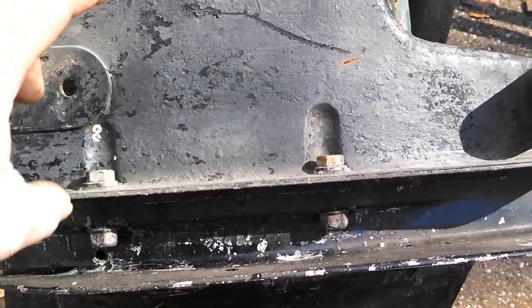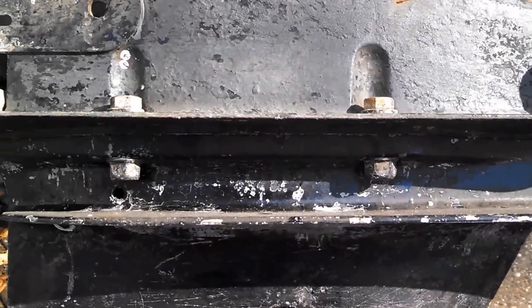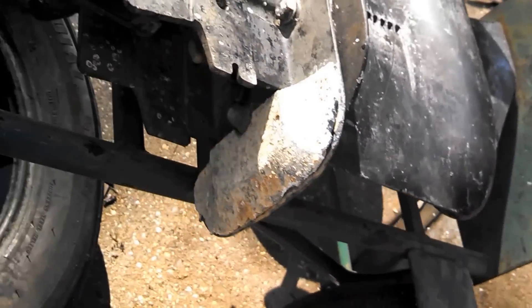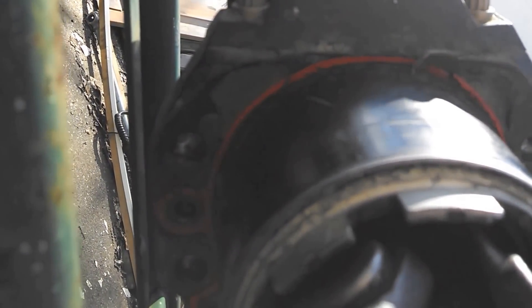Also, the mounting for the upper and the lower — the bolts go through; they're through-bolted. Instead, on the Alpha 1 Gen 1, the bolts go through the bottom and they're hidden. The other feature is over here you have this for the oil — you have this extra hole over here for the oil to fill the housing, which then runs through the transom assembly and then runs up into the back, inside the boat, to an oil reservoir to keep this thing topped off.